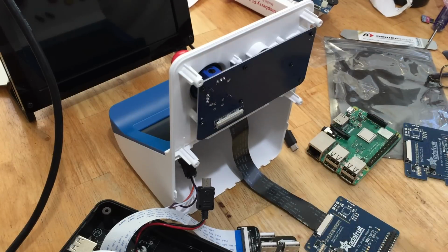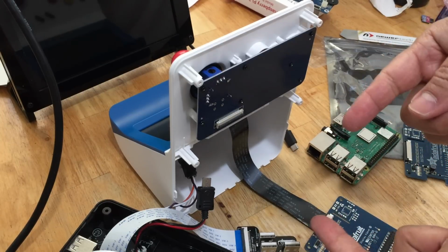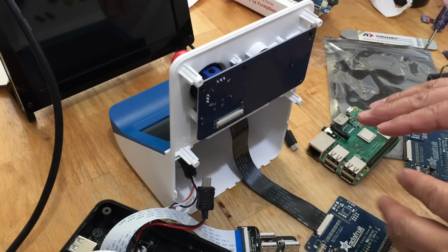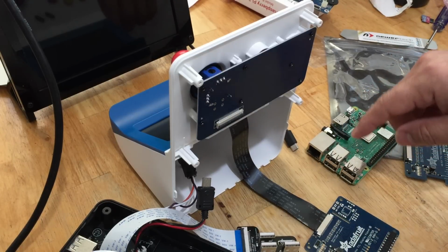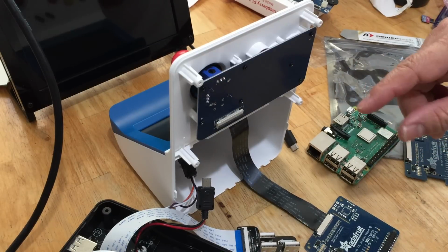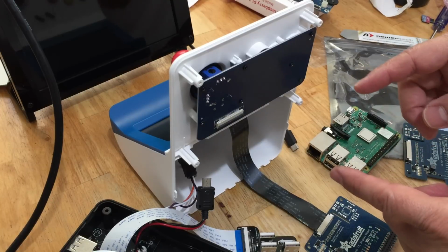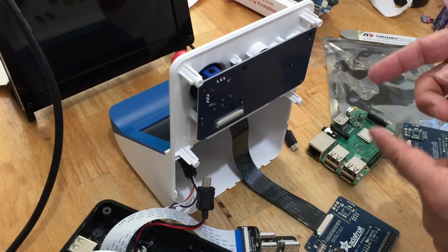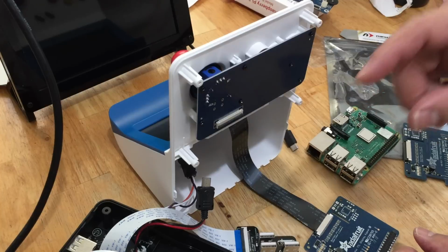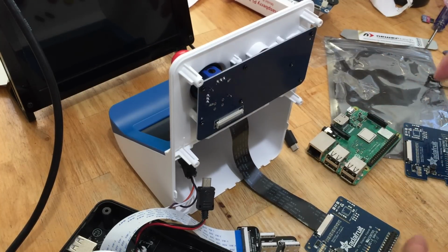I want to break this down in a little more detail on the connection. When I plugged everything in, my phone ran out of space, so I got disconnected. So I'm continuing with it. When I plugged everything in, I did find a problem with my setup in config.txt, and I will upload that to Google Drive so you can download it, rename your config.txt file to something like o-config.txt, and then replace it with the one I give you in the description. Download the config.txt and then copy it into your SD card drive.